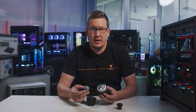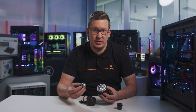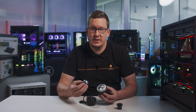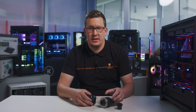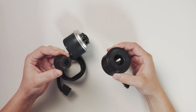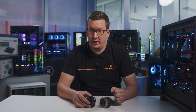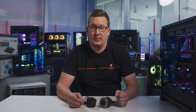It makes the pump very robust, and the parts that are exposed to the fluid are corrosion resistant, which provides an exceptionally long service time. The beauty of the ceramic bearing ball design is that even if the ball wears down, the rotor will still be balanced on it perfectly since the magnets inside the motor are pulling on it. Sleeve bearing type pumps can be more prone to issues because when the shaft wears down, the rotor will be able to move around, creating unwanted noise. I hope that we shared some interesting facts with you in this video. Until next time, goodbye!